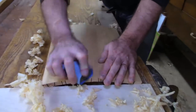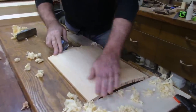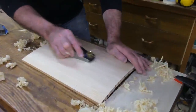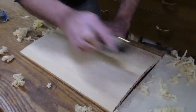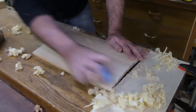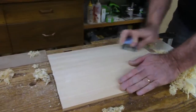Now, once you get it, you can sand. It's tempting to go diagonally, right, and then straight. You might have more to clean out if you go diagonally, but I would spend a little more time. Anywhere you feel a little ridginess, just hold right over that ridge. It's just going to be nuancing this thing until it feels sweet like a curve. And then after you're done sanding, you could use a little palm sander. You'll have a beautiful little lid like this.